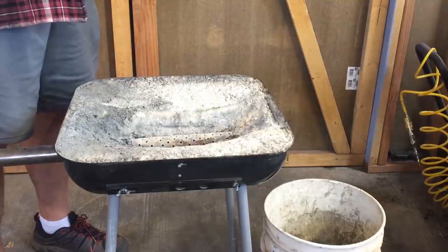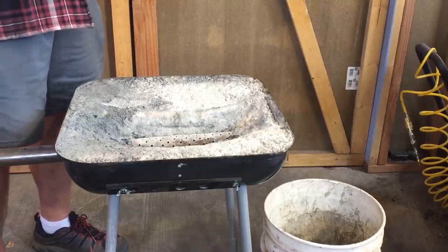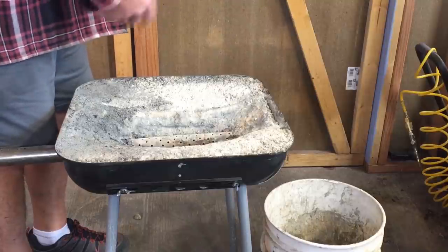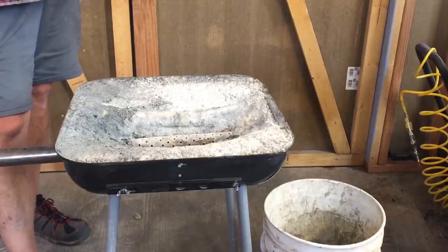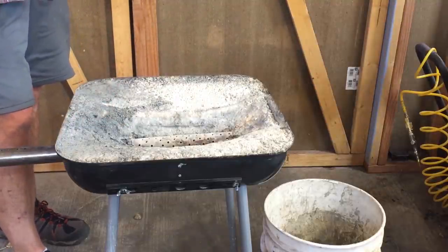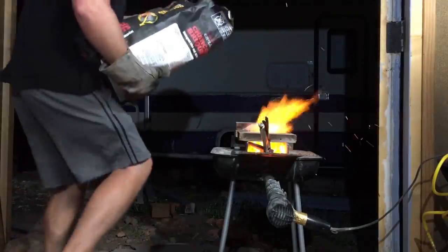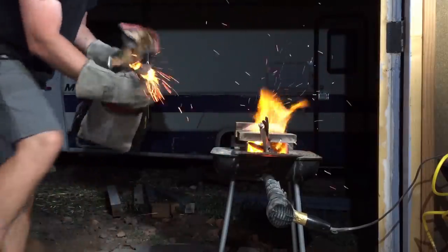Be aware that on rare occasions, if something didn't go quite right in the mix, there'll be a pocket of moisture in there someplace and it'll build up pressure and it can blow out the side. So you start with really, really low heat — maybe put some coals in there and light up the coals and just leave it alone, walk away and let those coals burn out. Then a few hours later, pile up more coals and get those going, let them burn out. Then maybe the next day, throw some coals in there and fire up the blow dryer and get the thing heating up, but keep your distance. Use goggles, use safety gear, big thick leather gloves and everything else.